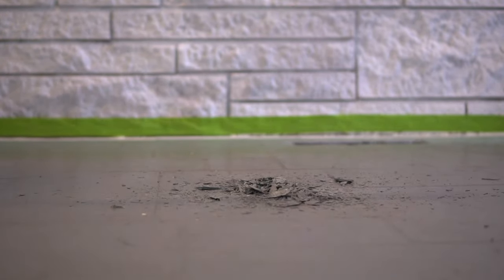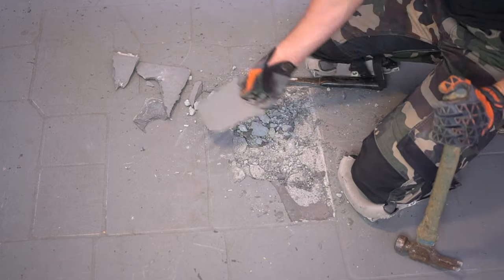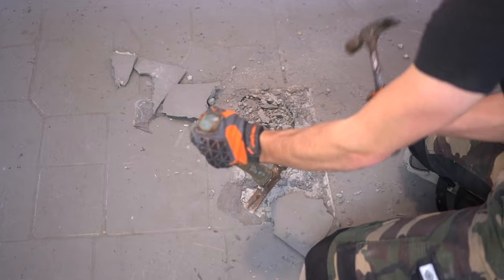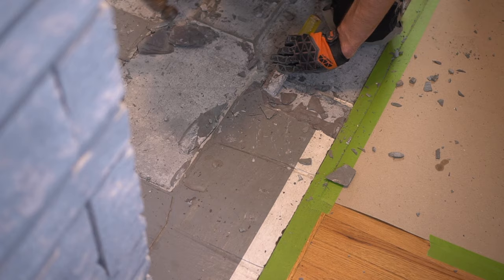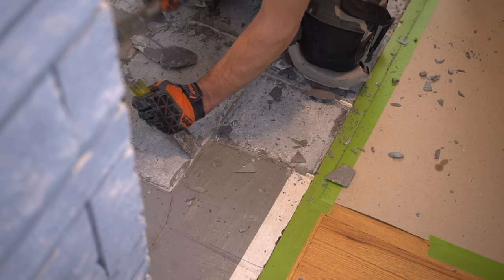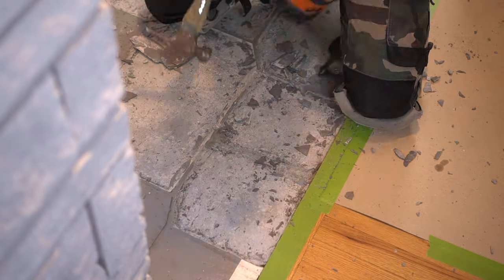This tile is from the 1950s and is on there quite well. I'm taking a large sledgehammer and chiseling away this slate tile, which is placed in a very thick mortar bed — approximately two inches thick. I don't want to completely remove the mortar bed since that's a lot of wasted material, so I'm trying to salvage as much as possible and level it out afterwards. The grout itself is actually even tougher to remove than the tile — it's on there like concrete on concrete.